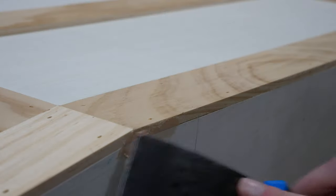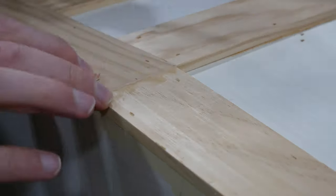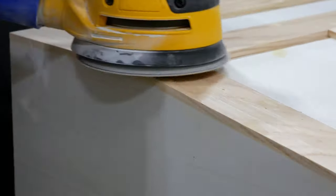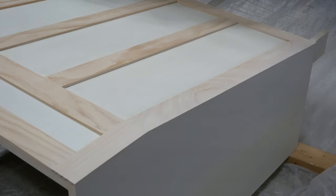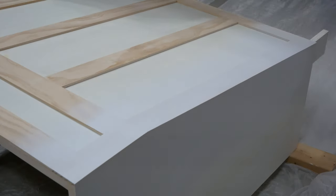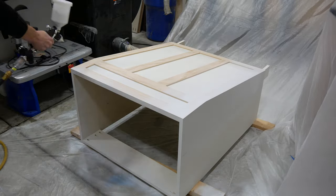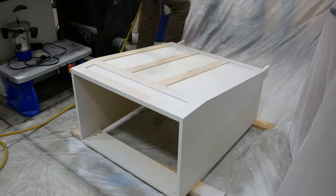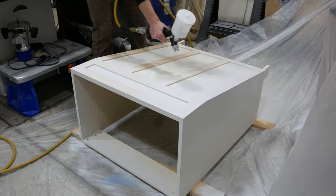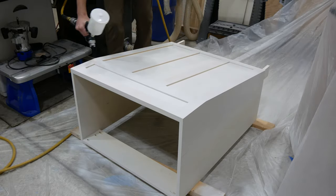The range hood cabinet is built and now it's time to make it look good. I filled the seams around the trim with wood filler as well as all the brad nail holes on the front, and when the filler was dry I sanded it smooth with 150 grit sandpaper on my orbital sander. I sprayed on a coat of primer thinned 10% with water using my paint sprayer, making smooth steady strokes overlapping each stroke slightly, spraying from about 6 to 8 inches above the surface. Moving around the cabinet was really cumbersome and actually caused me to make some mistakes spraying the primer, so I thought of a temporary solution.